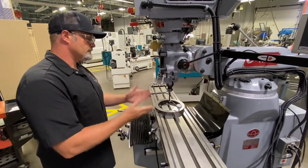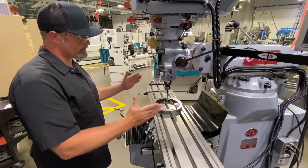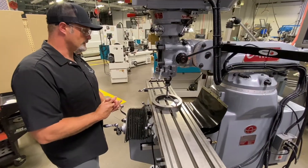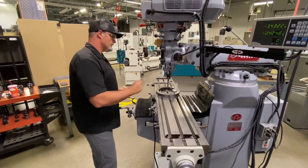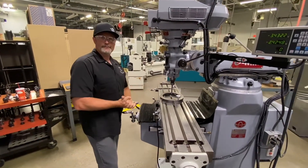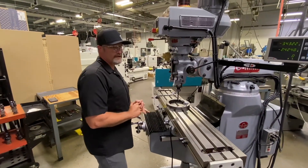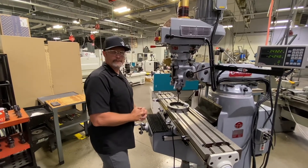There we have our head completely trammed so it's nice and square to our table. That way any kind of drilling operations, our holes are going to be nice and straight. Any kind of milling or face milling operations, the face of the tool will be nice and square to our table. That's our plunger indicator that we used here — it's a really nice tool for doing this job, not always accessible in most common machine shops. So I'm going to take a few minutes and get our one-inch travel indicator set up to do the same thing, just to show you how it's set up in the spindle.